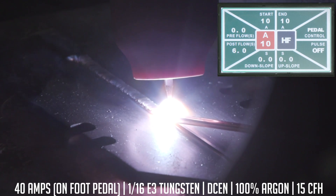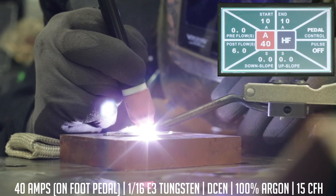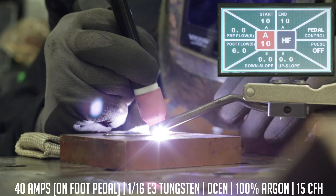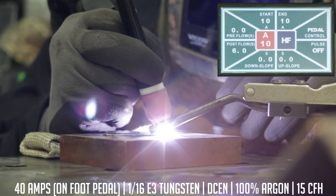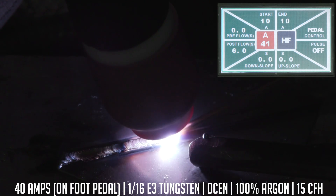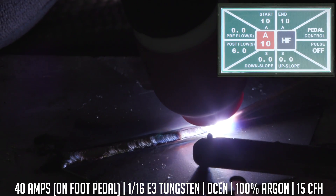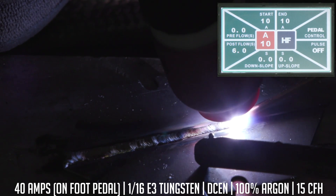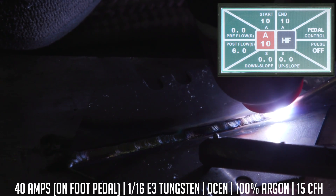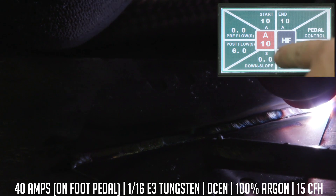The user interface is pretty intuitive. I like the fact that it has everything all in one area — pre-flow, post-flow — so if I need to make an adjustment, I can just cycle through and adjust that one. You don't have a bunch of knobs to deal with and hidden menus to go through. I'm using a 1/16th tungsten and 1/16th 70S6 filler because these are carbon box cutting blades. I'm going to light up on this copper block right outside the entryway to the two blades, using a lay wire technique, trying to put more of the heat into the wire than actually on the blades so they get residual heat and fuse together.